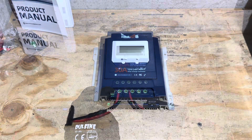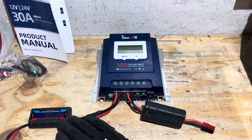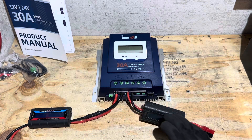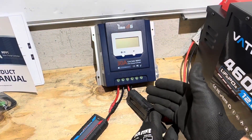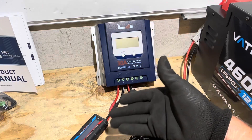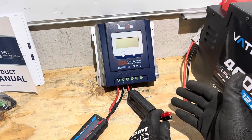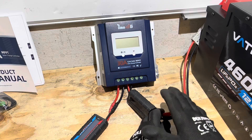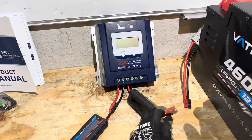I've attached an energy meter on the PV side coming in and on the battery side going out so we can track power moving through this controller. Of course, if you're using this permanently rather than for a test, you would have circuit protection on the PV side, load side, and battery side. I'm just doing a bench test without circuit protection, so keep that in mind — if you're installing it permanently, please use proper overcurrent protection devices.